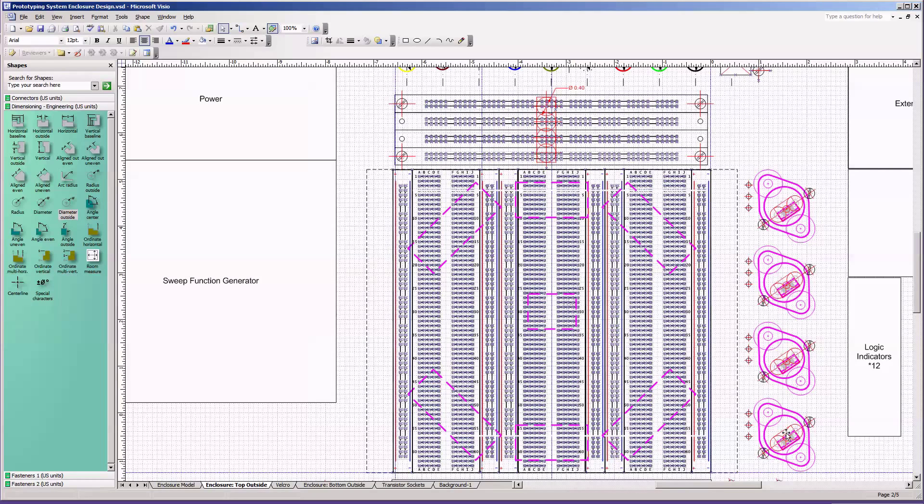I have the transistors' outlines there to prevent me from placing these transistor sockets too closely. I want to position them so that four transistor sockets are spread out within the available area, and also that they are positioned as close as possible, but not too close to the prototyping area. I've got about a tenth of an inch or so space between that and the closest edge of the feed-through.